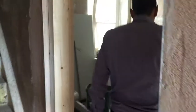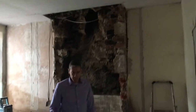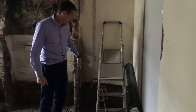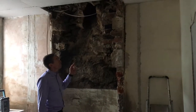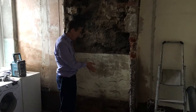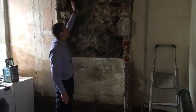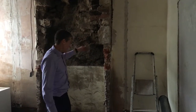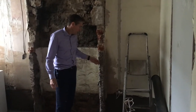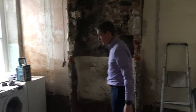But come into this room — this will be the living room for all the students. It had a particularly large chimney breast which made it very awkward to fit sofas in. These alcoves to the side of the chimney are often pretty much wasted space. Thankfully the chimney upstairs is only very shallow, so we're able to remove the chimney on the ground floor to a depth of just 15–20 centimetres. We're going to lock this up to support the chimney upstairs so that there are no steel beams or lintels needed. We'll have a chimney depth of 15–20 centimetres so we can actually put an L-shaped sofa or whatever, and the TV on the wall there, and make maximum use of the room.